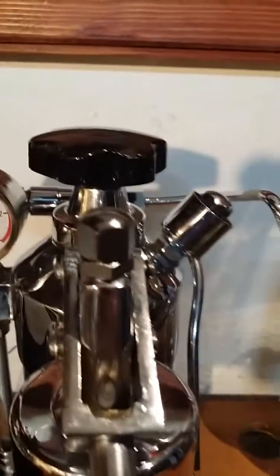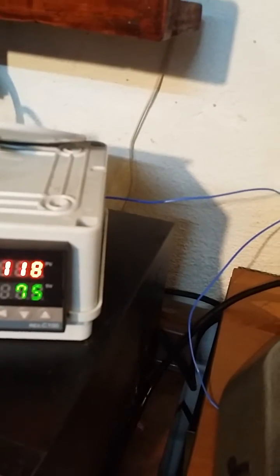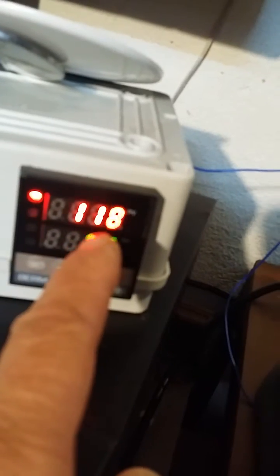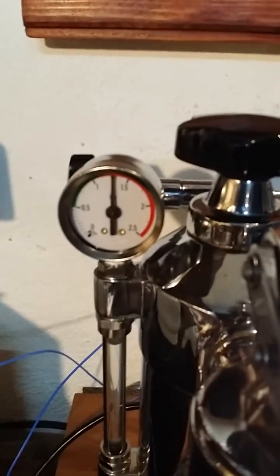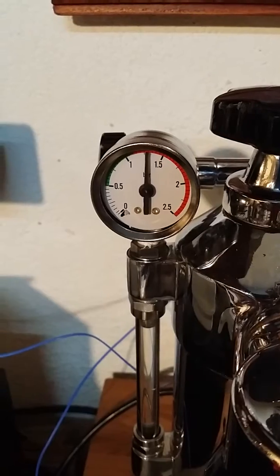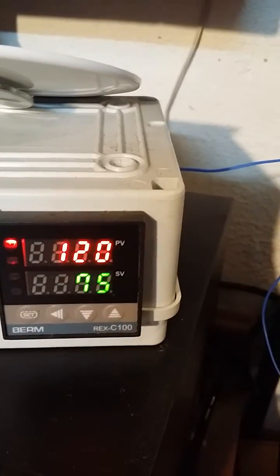Now I'm at high power at 1.25, 1.3 amps and the temperature is rising up. We will not be putting the resettable fuse at 118°C — it will reset if you use high power. Here at 1.3 amps, bulb fully open, 1.35 amps and we are stable at around 120°C.